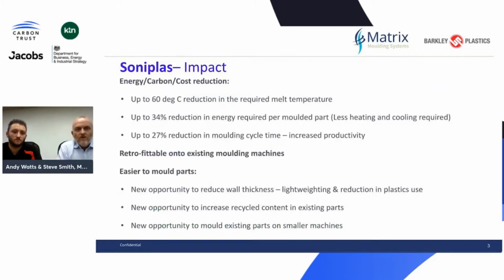So the impact of what we've developed in terms of energy, carbon and cost reduction is that we've been able to demonstrate a reduction in the melt temperature of a polymer by up to 60 degrees C. This gives us a reduction in the energy required per molded part of up to 34%, from less energy required for heating and cooling. And this also gives us a reduction in cycle time. We've seen a reduction of up to 27%,